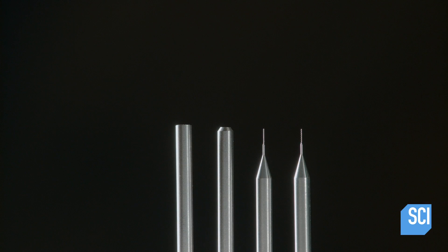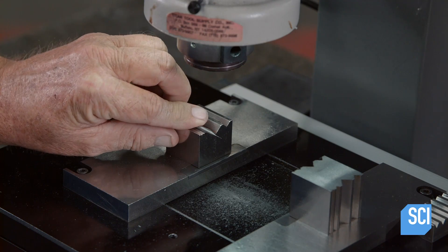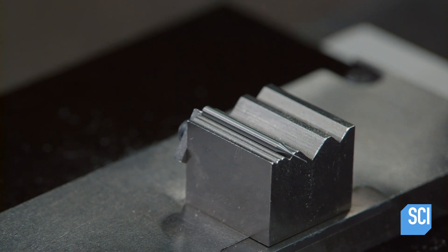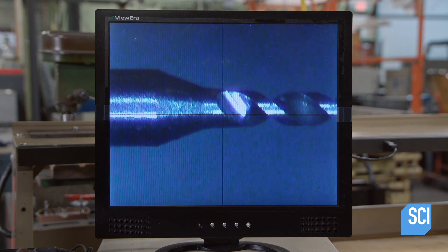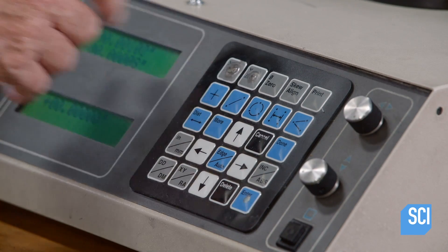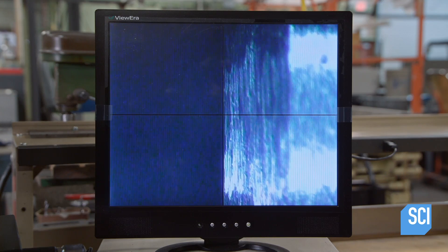It's impossible to see the difference between a bit before and after fluting. Using a magnifying device, the technician conducts a quality control check of the bit. As the screen reveals the finely cut flute, the technician ensures the tool's parameters meet manufacturing standards. One such parameter has to do with the shape of the flute, which has a forward taper — meaning the flute groove becomes shallower from tip to base at a very precise angle. This feature simultaneously strengthens the tool while increasing the chip flow along the groove.